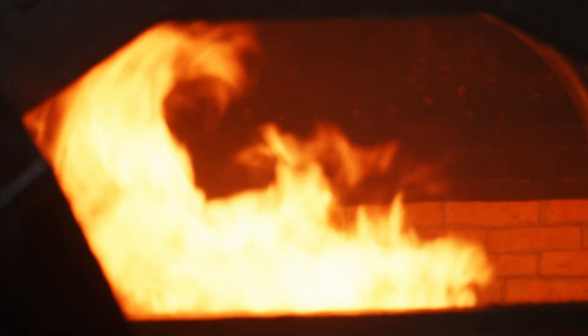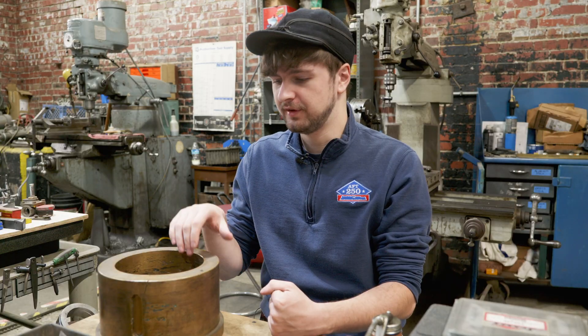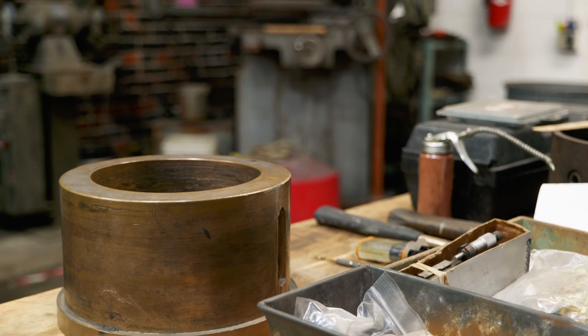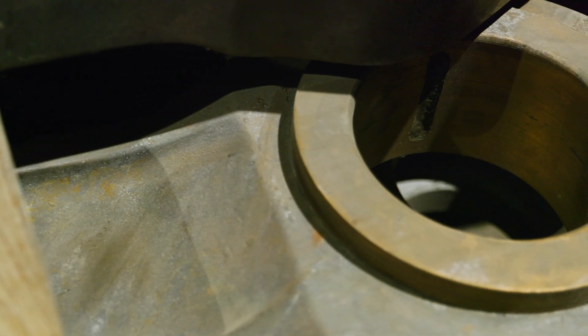As I mentioned earlier, we're kickstarting our last major mechanical projects to get the locomotive ready to move — that of course being the running gear. We're looking at phase one right here. This is one of the rod brasses out of the locomotive. Normally you would see this pressed inside a rod, and this is the wearing surface between the rod itself and the crank pin on the wheel as the locomotive moves. It's lubricated with hard grease.